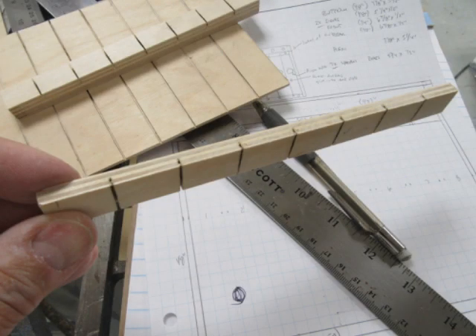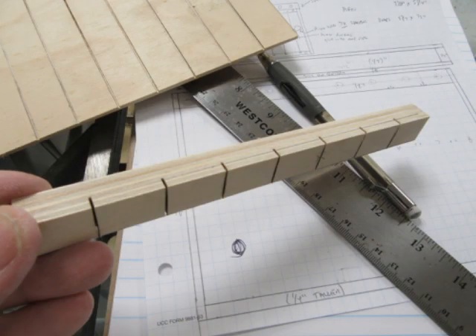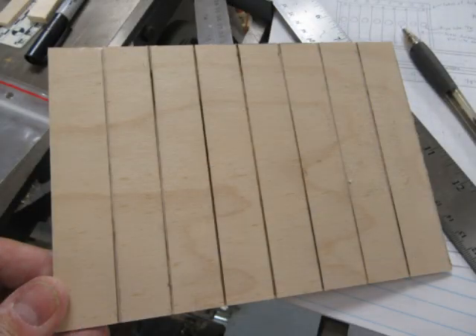I used my bandsaw to make seven slots in the front and rear panels to accept the brass divider strips. I raised the top head of the bandsaw a bit higher than normal and very carefully held the back plate — which is only eighth inch thick plywood — vertically on a little jig I rigged up, so I could almost re-saw the board to make slots for the bottoms of the divider plates. This was kind of tricky, but it worked out all right.